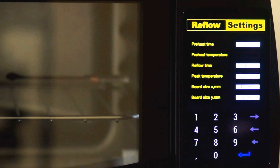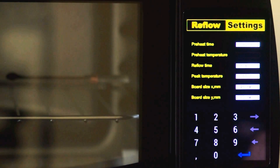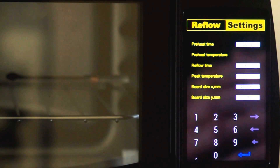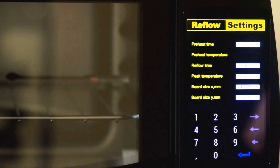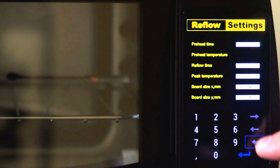It's a very low frequency processor. Someone said it's impossible to do a user interface with such a small processor and such a large screen, but I barely squeezed it into 2MB of SRAM as the frame buffer.